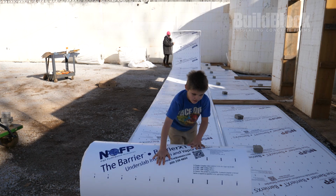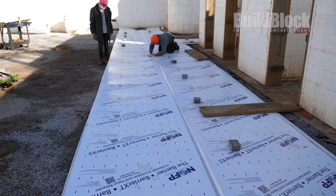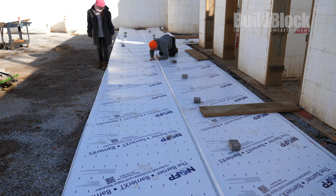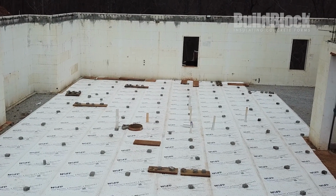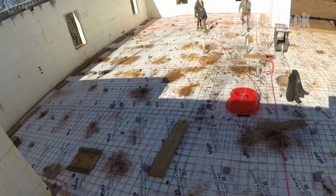Once the gravel has been placed and leveled, the team is ready to install their under-slab insulation. The insulation is rolled out and connected together via a built-in sticky adhesive. This insulation will help keep the poured concrete floor a more stable temperature and also provides protection from ground moisture. Sleeves for penetration such as natural gas, plumbing, electrical, and telecommunications are placed and installed as needed.